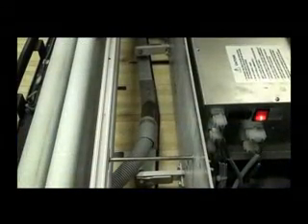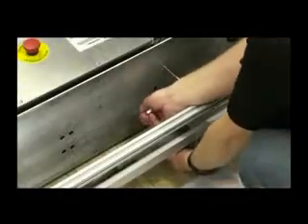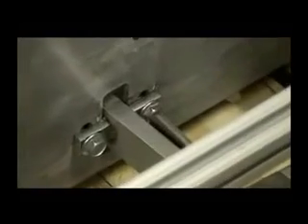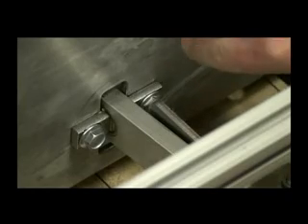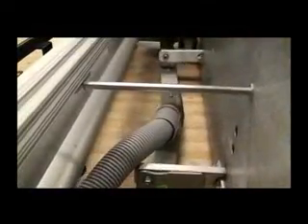Raise the squeegee using the Toggle Squeegee feature on the graphic user interface. Mark the current position of the squeegee pivot shaft on the side that has too much contact. Loosen the two mounting screws with the 1/2-inch wrench; the pivot shaft will drop to the bottom of the mounting slot. Raise the shaft to the top of the slot and position it about 1/16 of an inch below the highest position. Tighten the two mounting screws, lower the squeegee, and check the adjustment again.